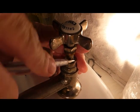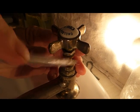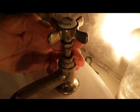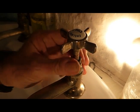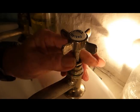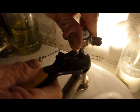This is called repacking a box on a tap — we call it a packing box. Once you've packed it down with your PTFE and it's in place, you should be able to start the thread back up. Start the thread, get it going, and then when you get it so far you should start to feel it bite and tighten.